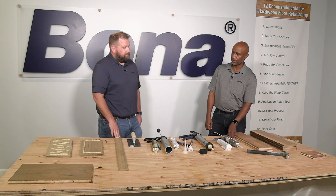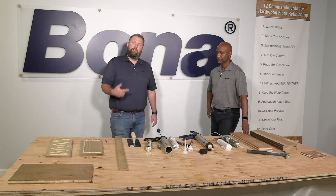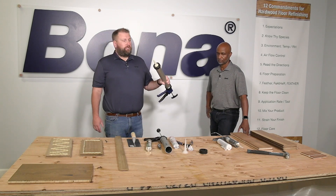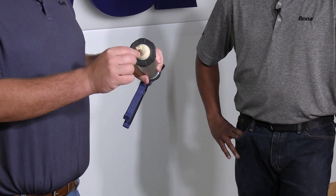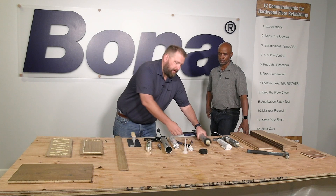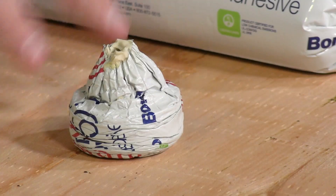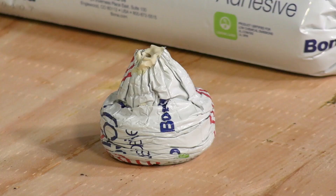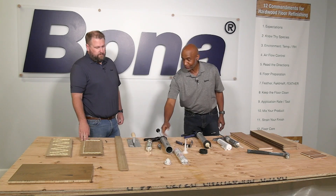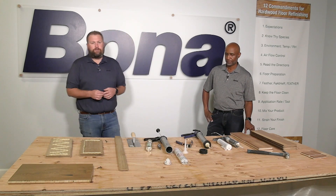The waste factor is a big deal. With a regular caulk gun tube, when you take the pressure off, it still leaks and keeps rolling out. If you don't use the whole tube, it starts curing and you lose material. With the R850T sausage, as soon as you release pressure it stops — just a small plug remains. And if you don't finish the tube, you don't lose it. At the end, all you're left with is the rolled-up foil — once again, 99.9% yield out of that tube.